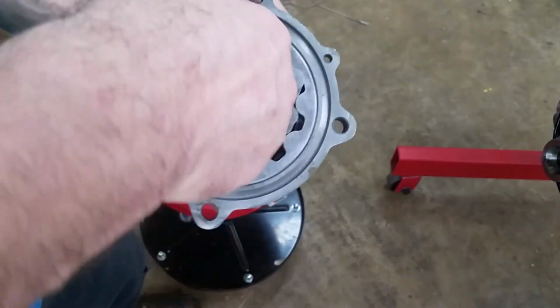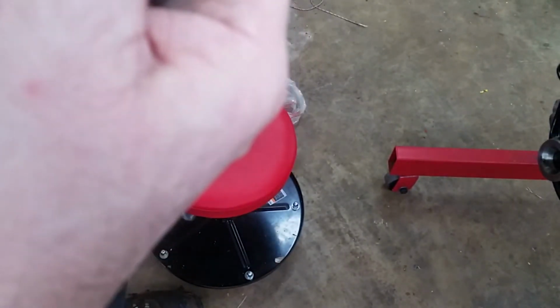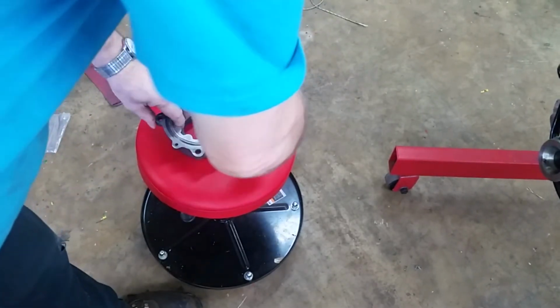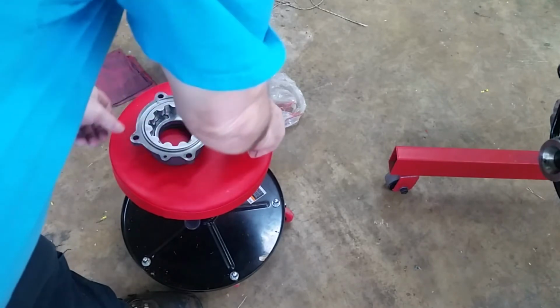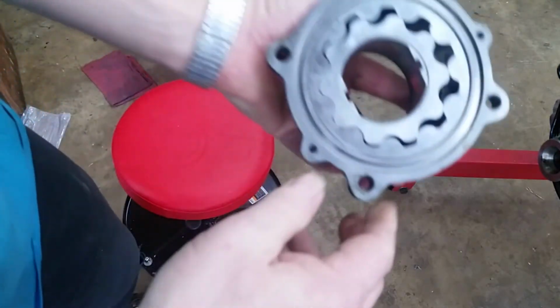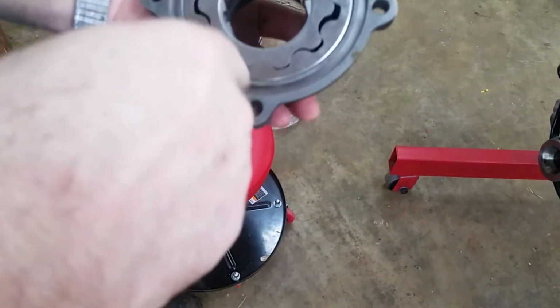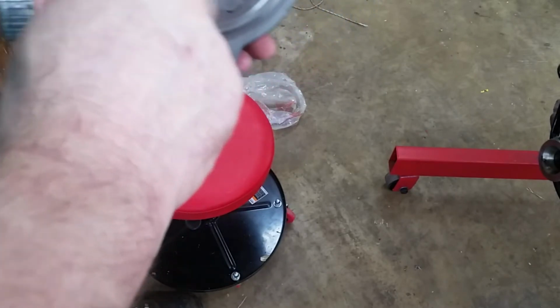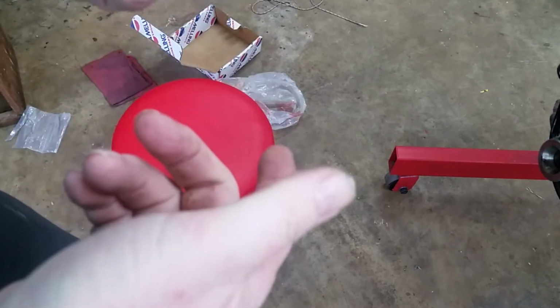Thing about these oil pumps, you should see, I don't see it on here. Wow. That's interesting. Set that the way it came out. There's usually one that says out or damper. But this is a redesigned pump from Melling. I'll go check it. I know it's got one extra lobe in it to provide more volume, and it's just their stock replacement, number 208. And it's already got the seal installed, so we're good on that.